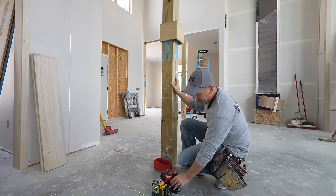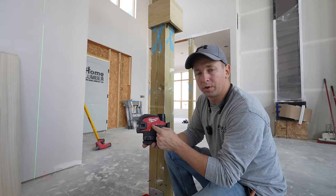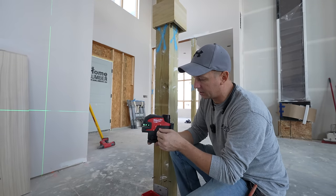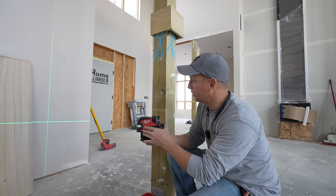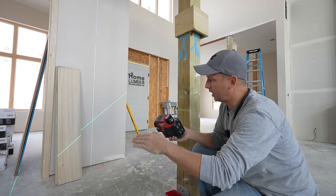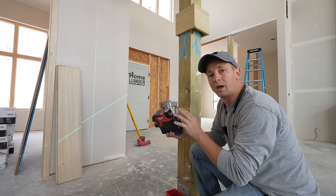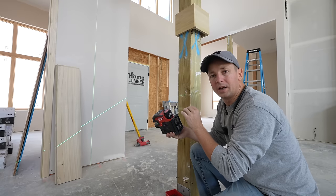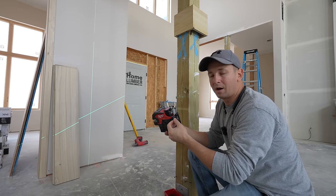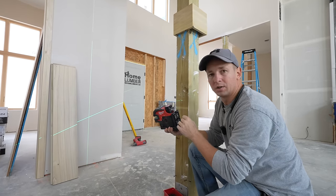One of the interesting features about the new Milwaukee is it is a locking laser. You've got three different settings with your turn knob: off, on with lock mode, and on with pendulum mode which is automatically going to plumb and level it. In lock mode you can completely turn the laser — so if you're doing some detail work where you want a laser line at an angle, you could mount this on a tripod or something like that. One key feature I love is that it blinks every so often so that you know you're in locked mode. If a novice accidentally sets it in locked mode, that could be a bad deal if it didn't alert you.